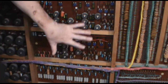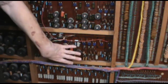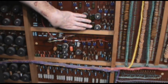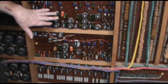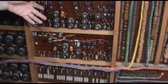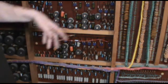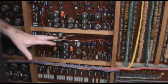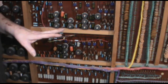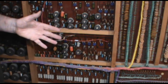So what we're looking at, and you can look at the earlier videos where I talked about how this circuitry works, is the filter boards for the main tone generator. There's a bank of oscillators, and they are routed to these various filter circuits to create different voices. So we have post horn, tuba, kinura, bombarde, clarinet, vox humana, strings, etc. Now there's three string stops on the 33E: from the main generator a viola d'orchestre and a solo flute, and then from a separate generator a celeste.